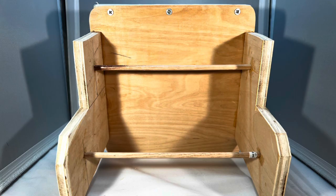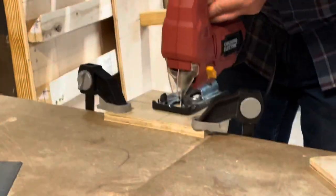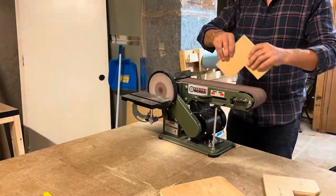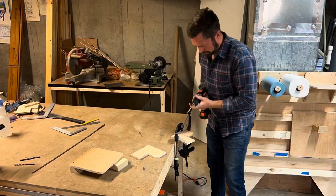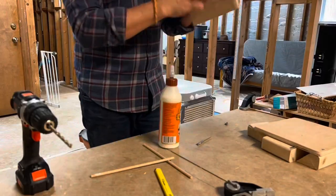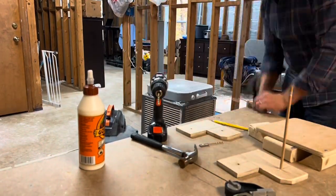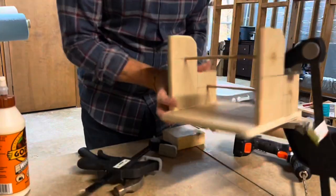Next was the pliers rack. At the start of this build I had no idea how I was going to get pliers mounted to this board, so I did some research. The best solution I could find was using a dowel to do a hanging rack. I decided to go with a two-tiered rack — essentially an L shape — using a quarter inch dowel. I started by cutting the outsides, making sure the backing board was already assembled, then drilled the quarter inch holes where the dowels were going to go and used wood glue to secure them. I ended up breaking one of the dowels and had to cut another one to length. Once both were mounted, I secured the other side with wood glue and made sure everything was flush, then mounted it to the backing board.